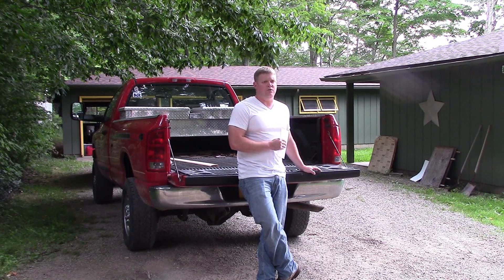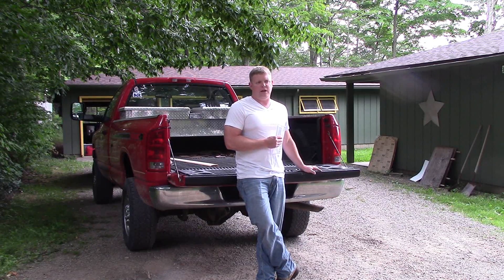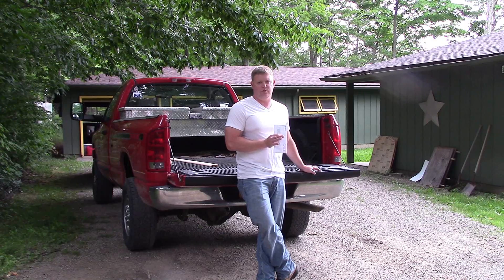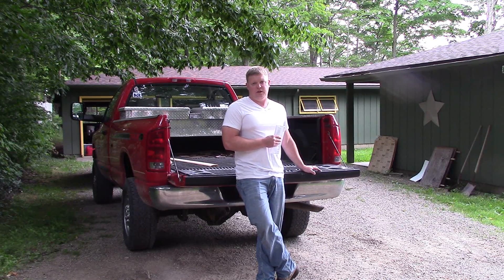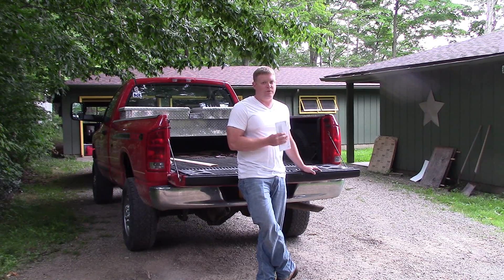You can also use a drill press to drill holes in each part of the anvil. If you do that, you're going to want to heat treat it because the railroad track is hard. Take a torch, heat it up to an orange-ish color, let it cool on its own, and it'll drill just fine. Also, you don't want to put it in any kind of saws — you're going to fry the blade, guaranteed. Do not put it in any kind of bandsaw or whatever.